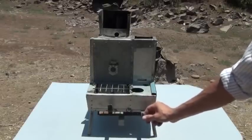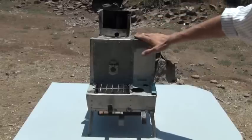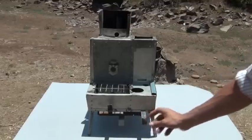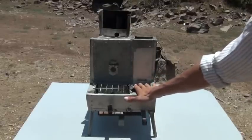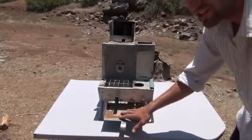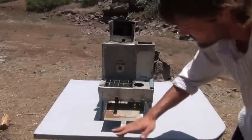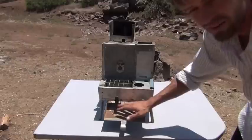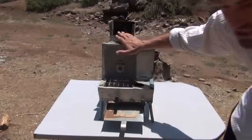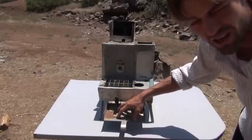There's another lever with a little tray underneath — this is a separate burner, a separate gasifier with its own tray, all isolated from the other one. Each one of these systems you can push in and out and pull the biochar underneath your warmer tray or hot pan tray. Underneath here is the final lever in the front — that's an ash catch. That ash catch catches every bit of ash or hot coals that fall through the system, keeps it below, and allows air draft to get up into the system from the bottom side.